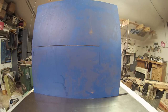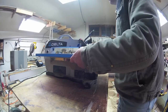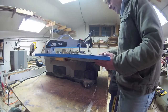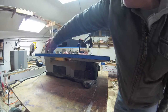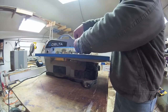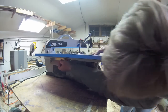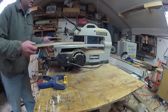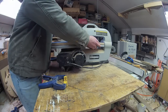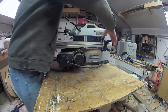Now to fit it to the saw. Taking our board, I'm going to carefully thread it down through the saw blade and push it up tight at the base in the back. It is tight and square against the back of the saw, and my blade is now centered. I'll drop the foot down and put a little pressure on it, just to use it as a makeshift clamp. When you're done cutting it out, you just slip it in on your blade, center it in the back, center it in the front, and I just use some quick release clamps.